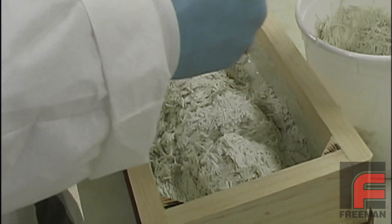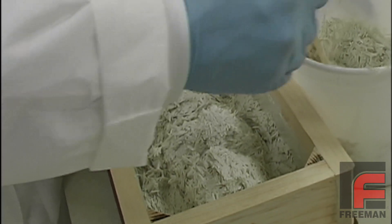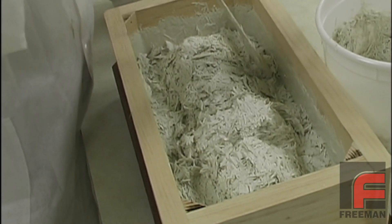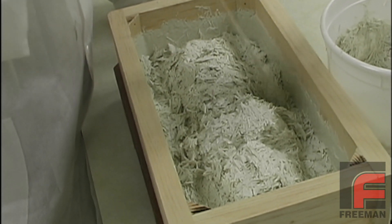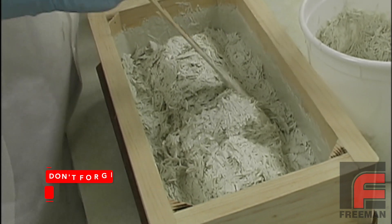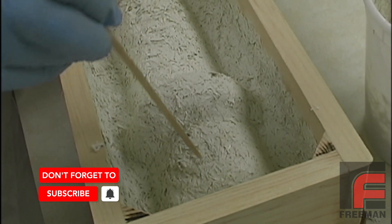As we progress, it may be difficult to see exactly how thick our tool is. We want 3 sixteenths to about a quarter of an inch thick. Notice how much easier it is to apply this thick of material than if we were using numerous layers of fiberglass cloth. This is one of the primary advantages of Repro surface coat and laminating resin.